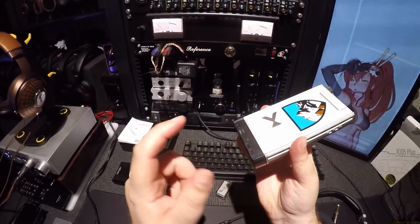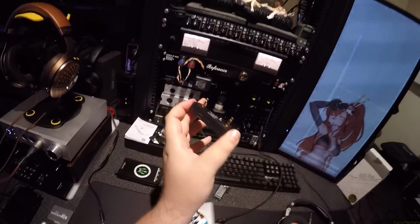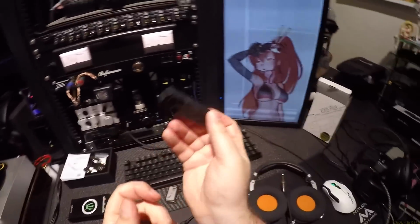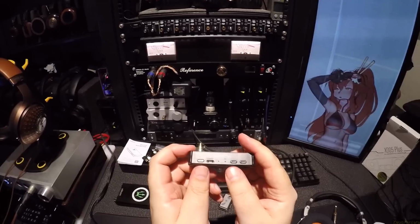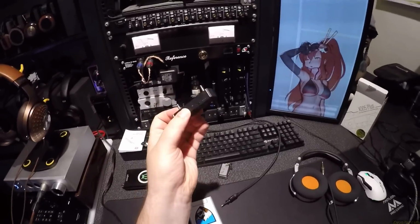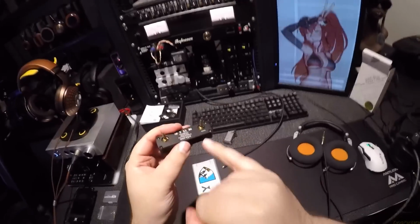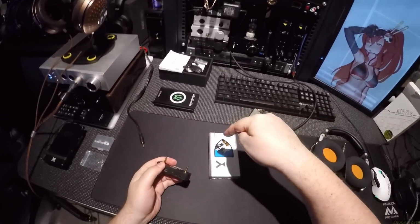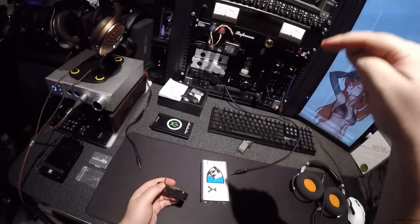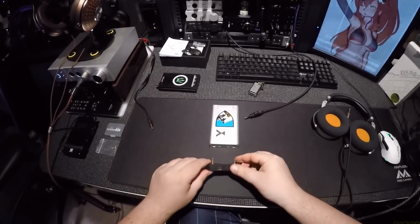My issue is with this particular one, mine, the one I have problems with. Mostly, nothing sound-wise. They claim Bluetooth 5.0, they claim all these things, and this isn't an analog input for this. In other words, a DAC isn't in this. It's a Bluetooth receiver that uses the coaxial digital output, so it keeps it digital until it feeds it into your $260 DAC, uses the DAC in here to decode. And then this is just a dead plug to mount it.